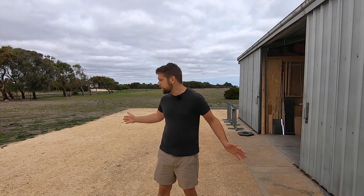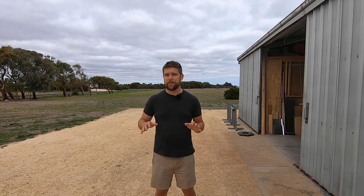Steel's all cut up and I'm ready to start welding the trailer. Problem is, the area I've got to weld up the trailer isn't that flat. That becomes a problem because if I weld up the trailer, by the time I put in the ribs and the chassis rails, if that thing has a twist in it, it's not coming out and that doesn't end well for anybody.